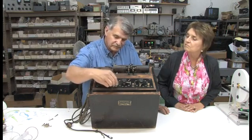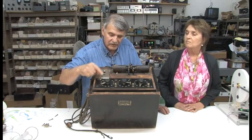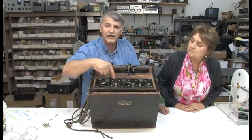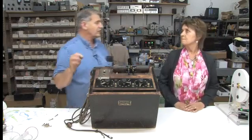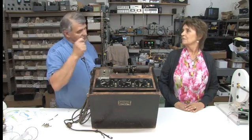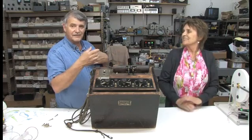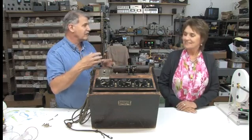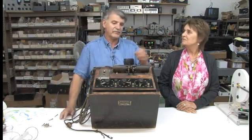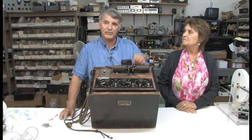And you push this little test switch right here, and then it made connection through the patient, and this light would light up. And now if you walked up to the patient when this machine was running with a neon bulb, and you were holding that neon bulb, every time the machine would tick-tock, you would see the neon bulb glow, and then go out, and then glow, and then go out. So you know it had to be above 90 volts that the patient was receiving, but feeble.